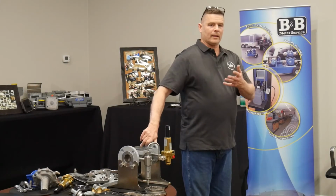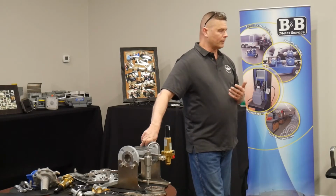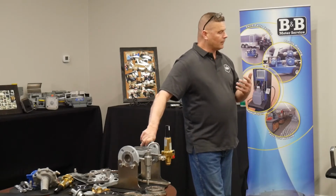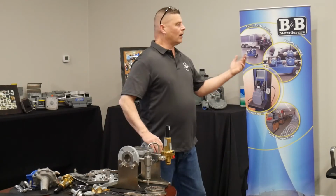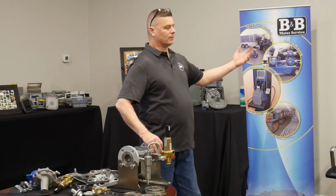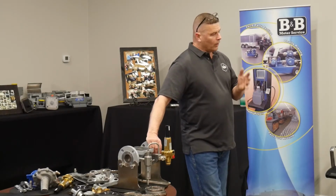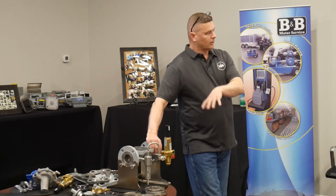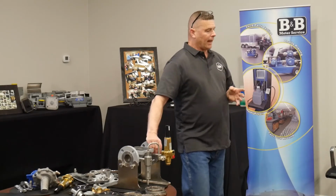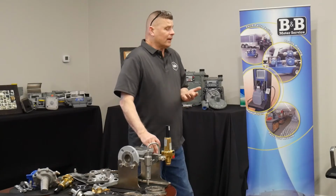The question comes up a lot, Casey mentioned the thing about how long can you be at emergency pressure? These things will come up where they'll say, well, how long before I have to change out the soft goods? Like what's the recommendation? The manufacturer recommendation is you go and inspect your soft goods annually and replace them as required.